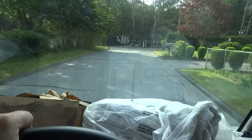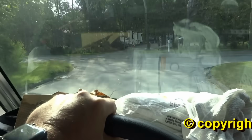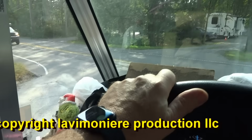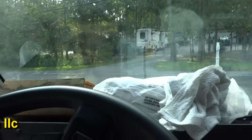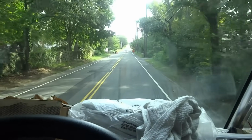This one here, I got a call for burner service, and also he says something about the circulator gaskets are all cracked. So he must have the football gaskets in there. Must have the football gaskets that are all cracked. I'm gonna try to get you some shots when I get over there.